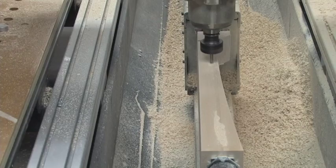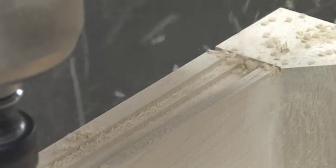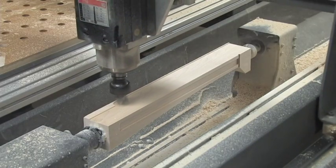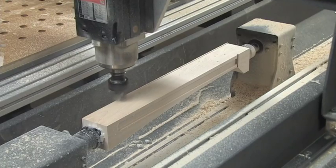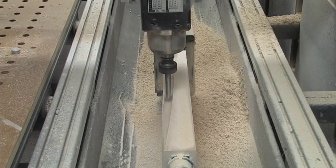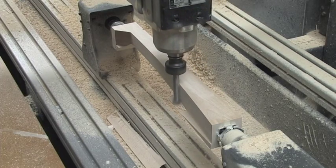To machine the dados, we used a 1/4 inch diameter end mill. We also used this cutter to score the top of the corner post. After the parts are completed, we'll use a saw to cut the parts to length, referencing the score mark. You'll notice that we programmed each side independently using CAD/CAM software. In our training classes, we'll also show you how to manually index the part to cut each side, or combine all of the programs together with the indexing process included in a single program.